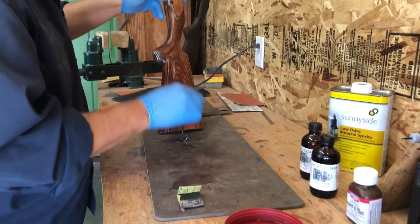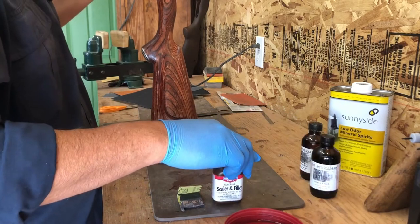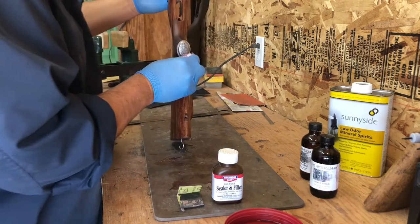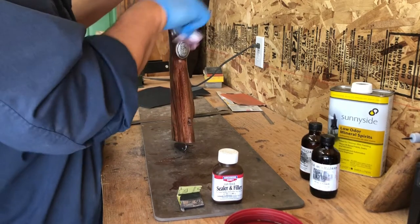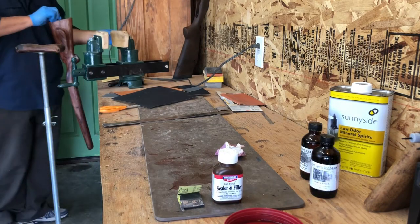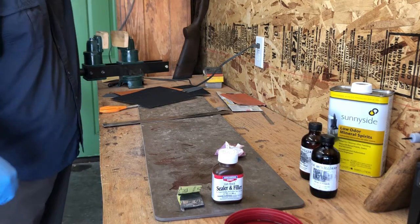After this I'm going to be putting on my filler. If you want to try it with your walnut stocks you can, but with a laminate stock it's necessary because of all the end grain I shaped into this stock — there are a lot of open areas I need to fill. I could sand in the traditional way like I would with walnut forever and those grain areas would never fill. I'll cover the filler in probably the next video. For now I'll hang this up to dry, close up the hot box, and turn on the heat source.